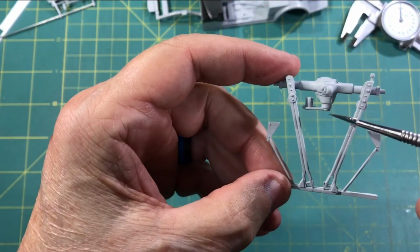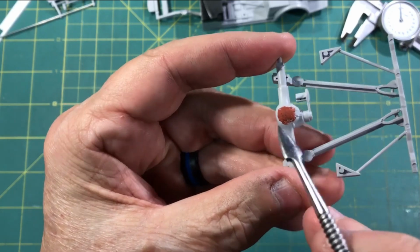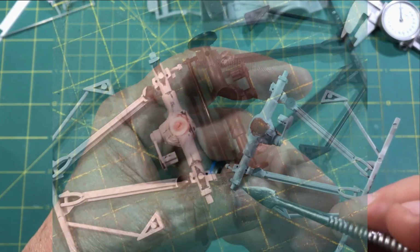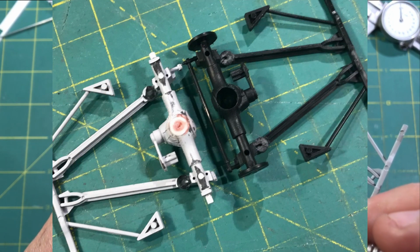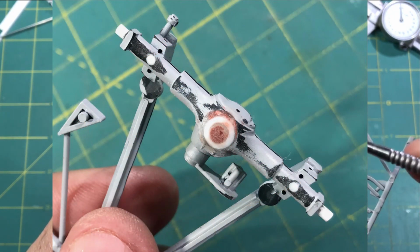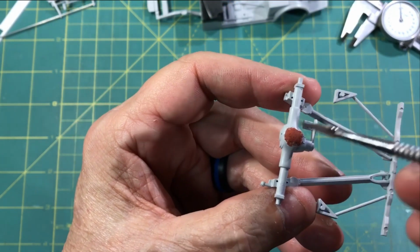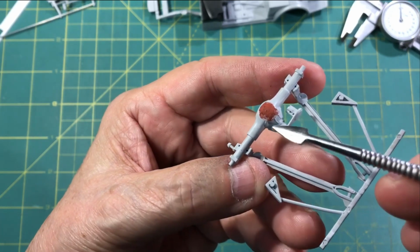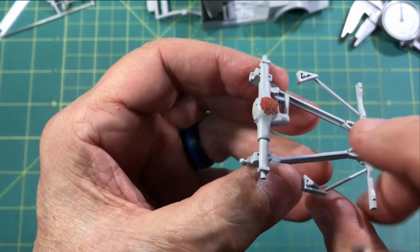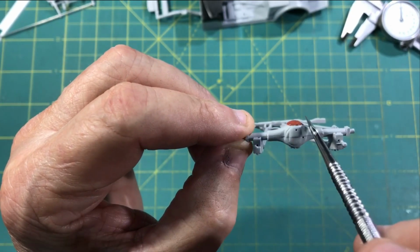The rear end cooling pump, we've got our holes drilled here and here for that. And you see what we did on these holes. Well, let me show you this picture before we put primer on it. You see where the plastic rod was put down in those, filled in, and it's been sanded smooth. And then I just used some scrap sheet plastic and filled up that great big hole, as you see here. And then we've got our final coat of putty over it. And as you see here, we've got a round shape back to the top.